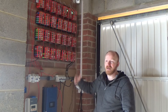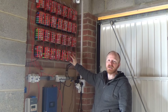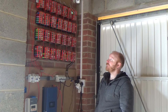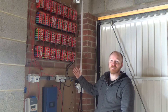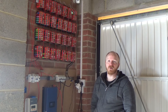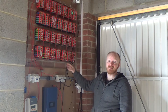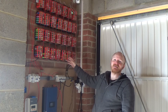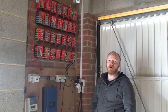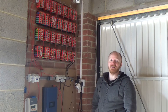I think I'm going to have to take this apart and look at that again. I have toyed with the idea of basically pulling everything apart, getting all the individual cells out, and then retesting everything and going through that whole arduous procedure again. Maybe I'll lose a few cells, so maybe it ends up 80p instead of 96p. I'm also considering using the pre-manufactured holders that are quite popular — the likes of PET and DIY Powerwall have used — and making up some packs that way with the thicker bus bars. Paul Kennett's design is brilliant and works really well, but as I've scaled it up, it was never really designed to scale up to 96p, and that maybe needs to be revisited. As far as the gauge of the wire and the loads I'm putting on it, it's pretty fine and there's nothing dangerous, but if I want to do anything more serious inverter-wise or draw-wise, I need to start looking at that.